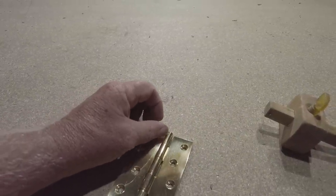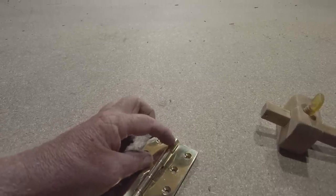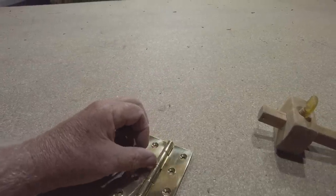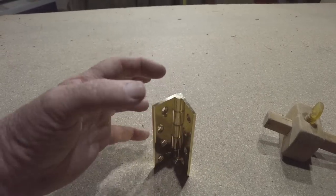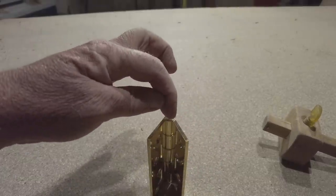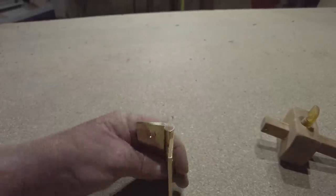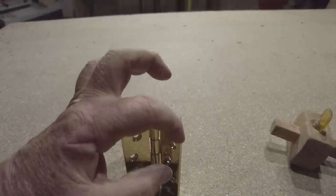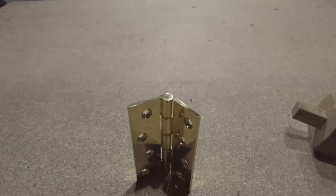And in between the joint, the butts, if you like, where they go through the tube, there's a steel bar that goes through the center here, and then in between them there's a washer on each one. And those washers are bronze washers, and they give it a very, very long-lasting ability, and it lasts a long time. Okay, we call this the leaf side, and we call this the butt side of the hinge. The leaf side, which you'll see a little split there, that's the leaf side there. That goes on the door. So you're putting a door on, or a window, or whatever.